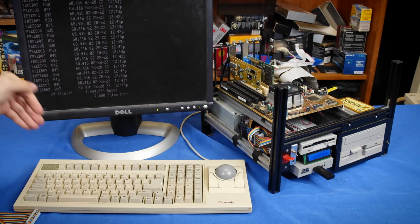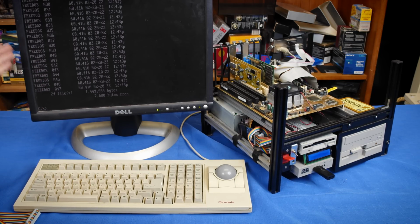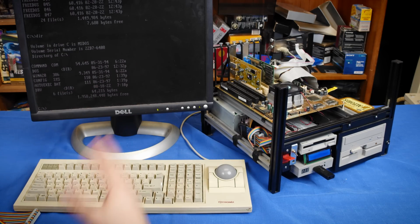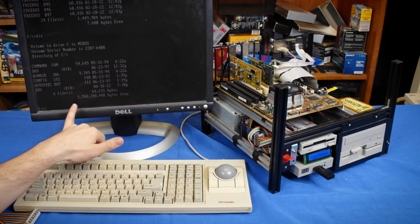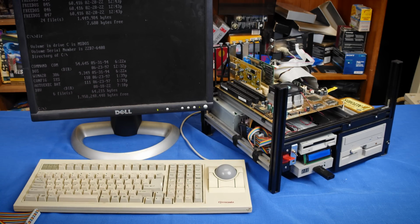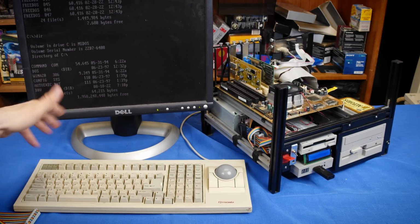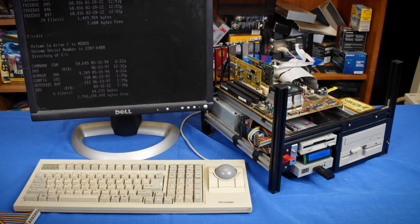This is because DOS caches the drive file index, so it doesn't have to rerun that again. It's just the same kind of thing as when you run dir on something like a 5150 and it has to calculate the bytes free the first time. It's caching some information about the file system so that it doesn't have to rerun that every single time.